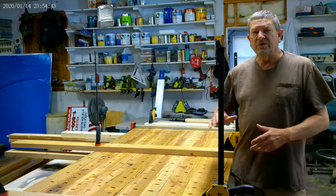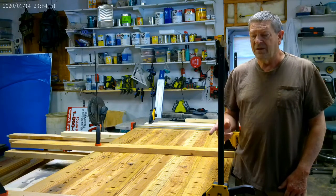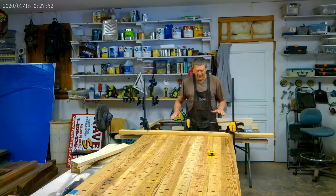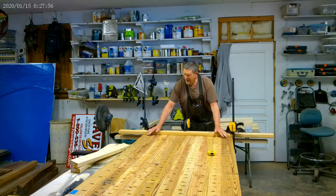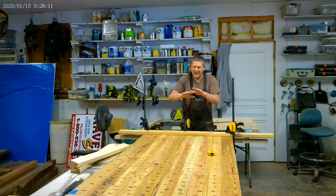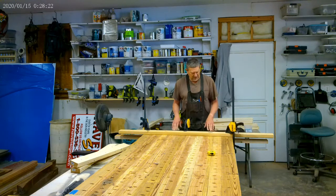Now I'll flip it over and sand it to get it all smooth. I'm going to put the end pieces on using these braces and clamps. If the tabletop has any tendency to curl up on the ends, this straight end piece will take care of that permanently — even after you remove all the clamps, if it tries to come up a little, the end piece will hold it flat forevermore. I'll screw it on and then move to the other end.